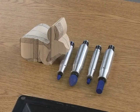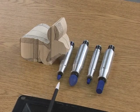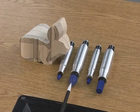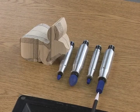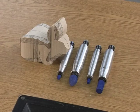I am fortunate enough over the years to have accumulated enough hand pieces so that I can set up those bits that I want for a particular sequence so that I don't have to stop and reload each hand piece. Now for this particular project and for starting the initial cuts, we're going to use a small flame-shaped Typhoon, a large flame-shaped Typhoon, a cylinder smooth end small, and a cylinder smooth end large. Those areas that demand a particular shape for removal of stock will dictate which of the four bits that I've chosen and set up in preparation I use.